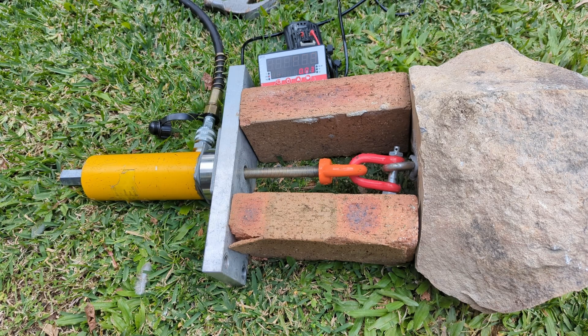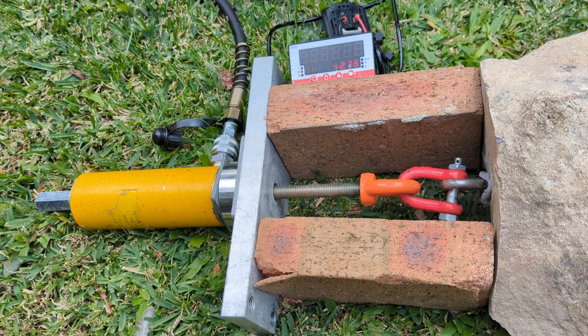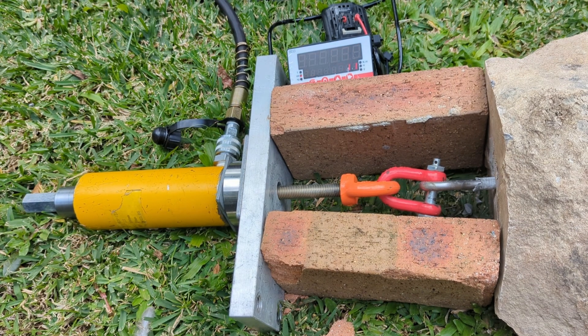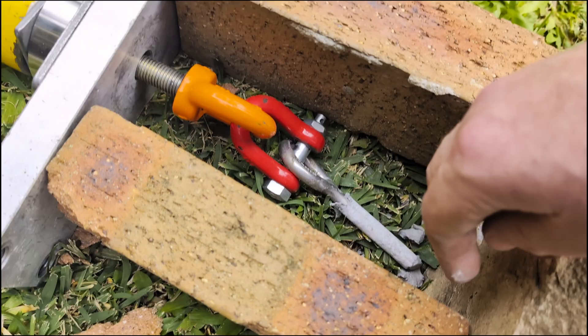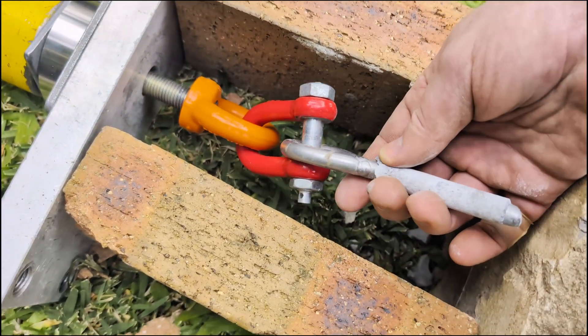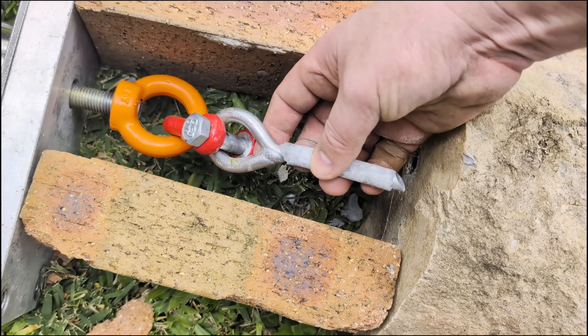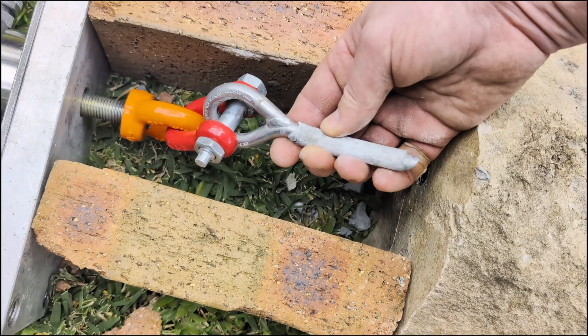Here's the Superstar: 37.30. I probably shouldn't just be standing over this. 50... 53. Hell yeah — look at that. These rammer bolts are bloody good. That's the third pull exceeding 50 kilonewtons that this particular bolt has had, I think.